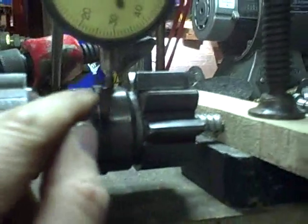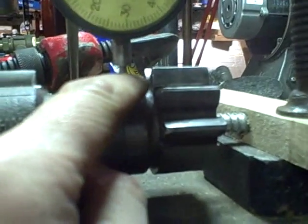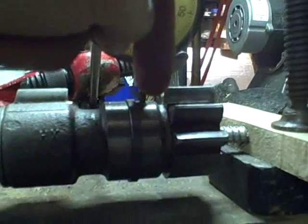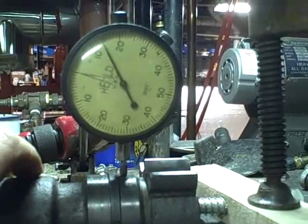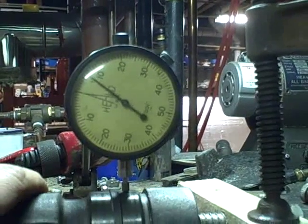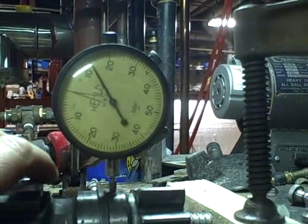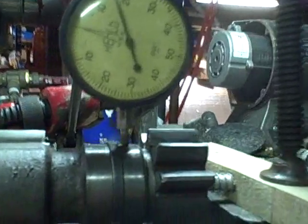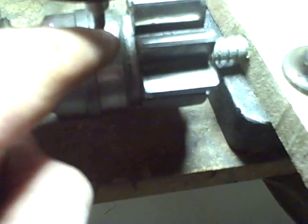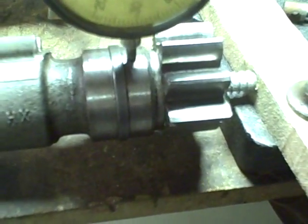I said exact location, but there's going to be some error, just because as I move the dial indicator jig over it may have changed its position as to where it's actually taking that measurement. But that should be the high spot, and as I rotate — I didn't zero it out this time because I don't really care about that now. If I zero it out, you see it goes down and then it's coming back up to the high spot again. Looks like the high spot's right there — you can see there's my first dot — and actually it's pretty good, it's almost right on. So that's my high spot.